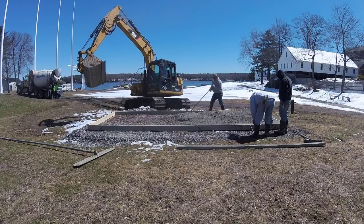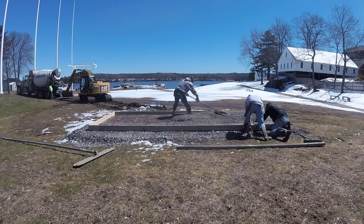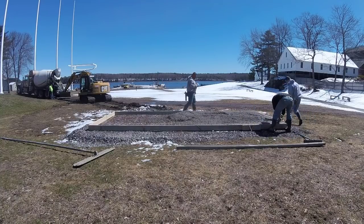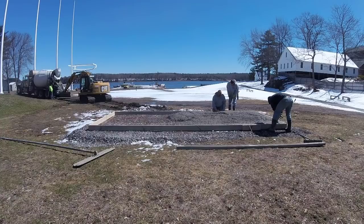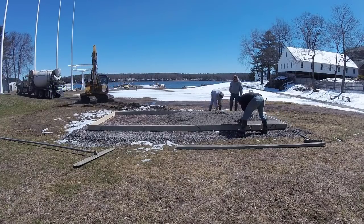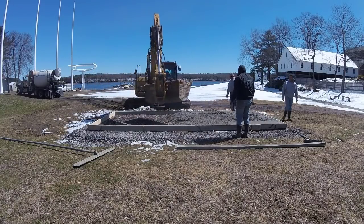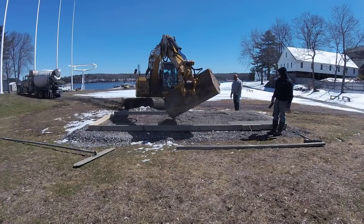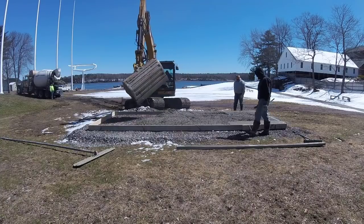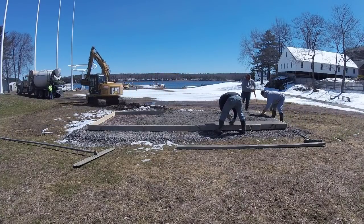He's got it about half poured out now. I'm going to put a little brace on one of those boards — the board started to kick out. As you can see, there's snow on the ground; it's still a little chilly, but no frost in the ground and it was about 50 degrees today. The crushed rock sometimes doesn't hold those pins very well, so we've got to keep an eye on our boards. We've got a string line on it to keep it straight.